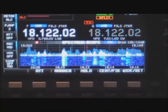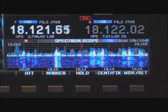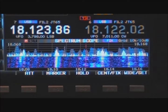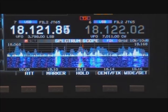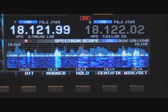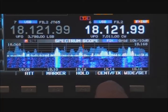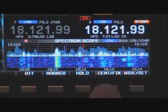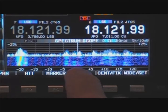Now I'm going to zoom into the band scope display. Right now the band scope is showing across the entire 17 meter band. If I adjust the transmit frequency, you'll see the marker on the band scope moves to indicate what frequency I'm listening on. So we're going to put this back on the frequency for the Ivory Coast station — 18.122. We're going to equalize the VFOs. It switched control over to the transmit VFO. Now we're going to change the band scope display — instead of tuning across the whole band, we're going to center the receive frequency in the middle of the scope. On the ICOM 7600, you push the center button, and now that centers his frequency, 18.122, in the middle of the scope.